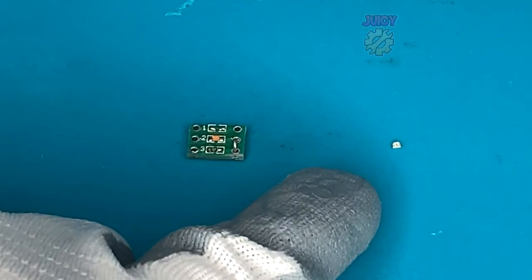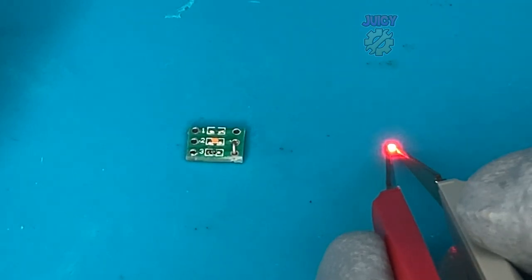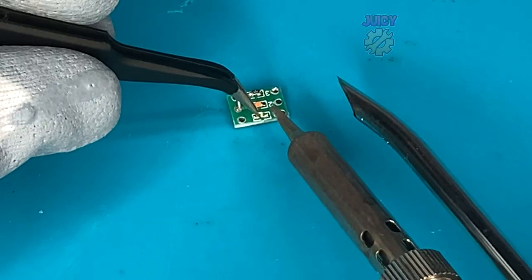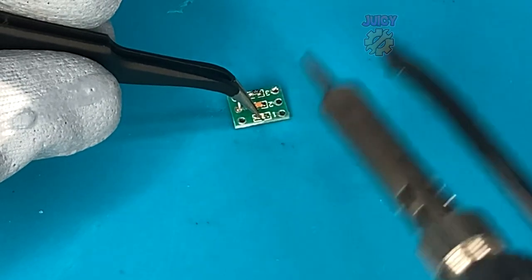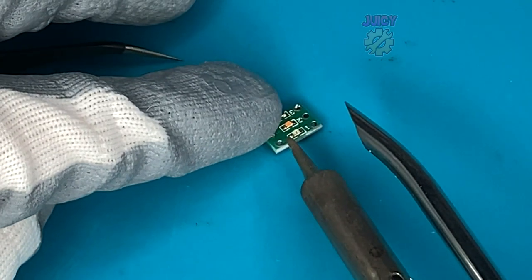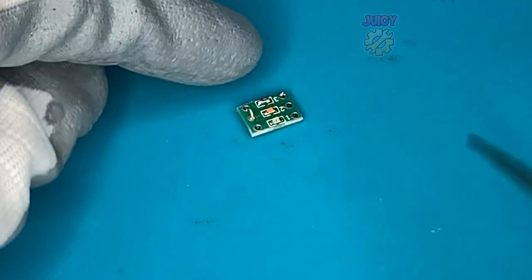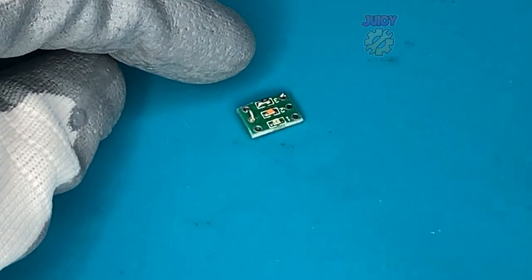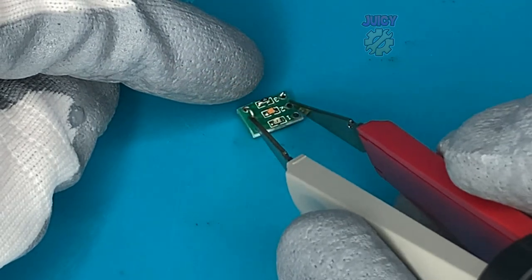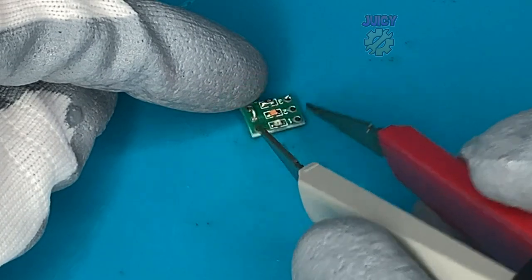I'm not going to use the original red LED - it'll be way too big. I'm going to use this tiny one here; this is the kind of color you would expect. Let's get this on to the top pads of this little board. Again, let's use our test tweezers just to make sure it's on the right way and it works. Look at that - these will be our colors. As you can see, you have the original power LED and the new charging one.